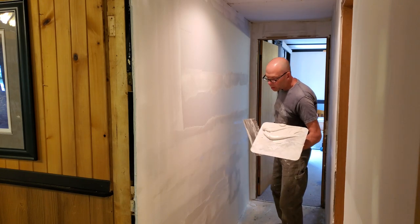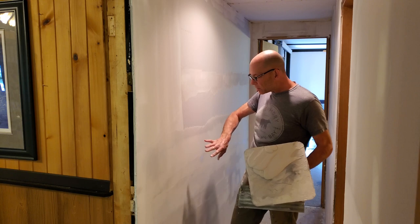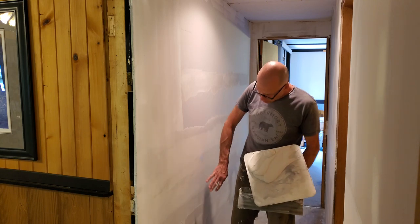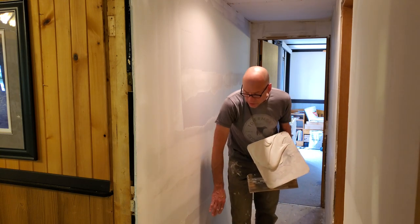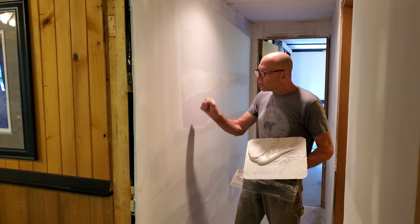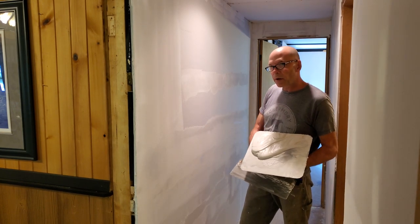Looks like we're putting on a lot of plaster. And kind of I am, but it's a lot easier to feather it out wider and have it nice and smooth, and to cover all of this rough stuff here with a wider swath of plaster and then just get a light skiff sanding over top. It's easier to do that than to have a little hump that you gotta really, really sand a lot. So maybe it looks kind of daunting doing that, but it's not that bad.